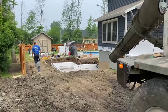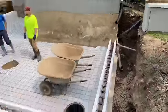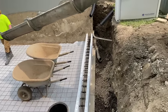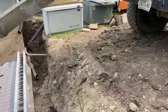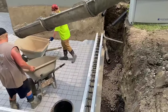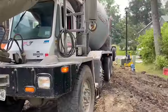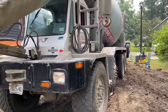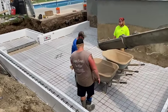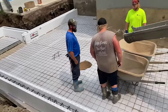We are gonna pull him up in here, fill up the old Brentwoods. We're gonna fill the jack post pad first with some thicker concrete. That's probably good right there. We don't need no cave-ins today. Mix her up a little bit. We're gonna try to shoot for like a 5.5-6 slump, but we're gonna put maybe a 4.5-5 slump down in that hole first. First thing we'll do.